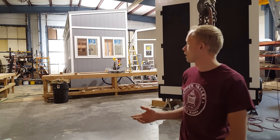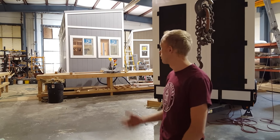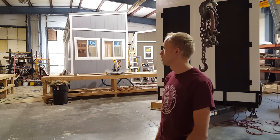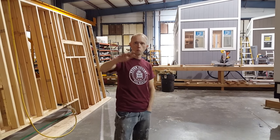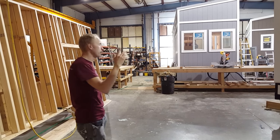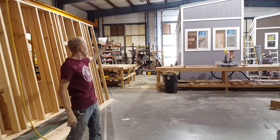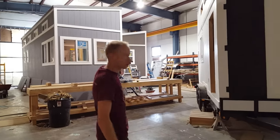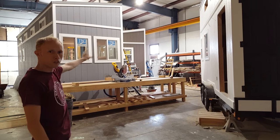I try to keep the system together. I originally started in my backyard, like a lot of other builders. Now we have about 12 more homes to build and need a system to keep everybody on schedule. We frame everything on the floor, pre-set walls, pull trailers in, put sheet insulation on the trailers, put walls on, then the mechanical guy comes right behind doing all plumbing and electrical. All our houses are in stages — we have one in the mechanical stage, one in the drywall stage, and one in the finish stage with painters and trim work going on right now.